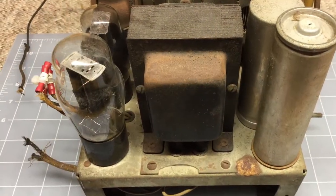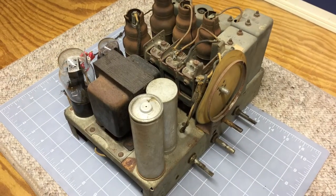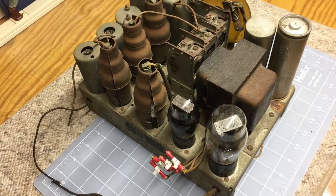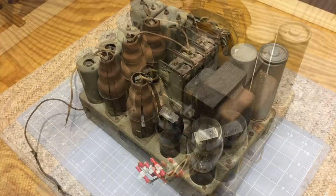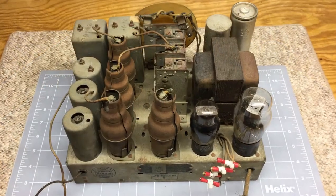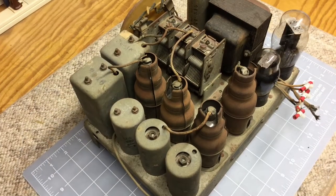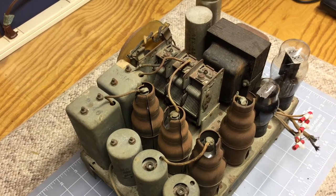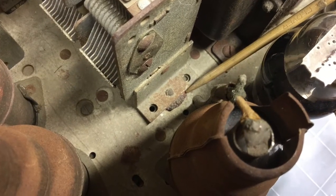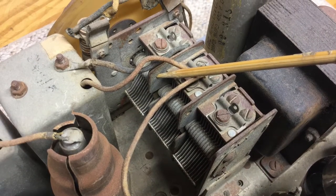Let's take another quick look at the top of the chassis. I'm going to get these tubes removed so I can go ahead and get that tuning condenser out, as well as the power transformer. You can see all the rust on the old tube shields, which I'll have to take care of — and a lot of rust on that tuning condenser. The power transformer, one side of it is definitely rusted up. And the chassis itself has a few spots with rust. You can also see the old grommets that hold the tuning condenser are in bad shape — we'll have to get those swapped out as well.